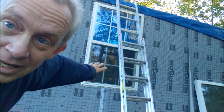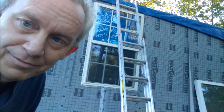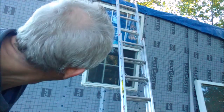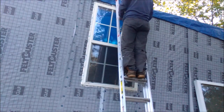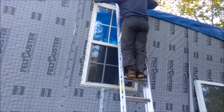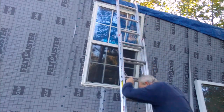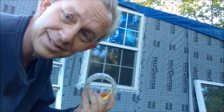This is a used window, and I noticed right around the edge they used Tyvek tape to seal it up — I didn't see any silicone or caulk, so I guess they just used Tyvek tape. I thought that was a good idea so I'm going to do the same thing. I'm going to finish up this wall with Tyvek tape on all the seams. I'm really glad the subscriber told me about this — it's going to seal up the house real nice.